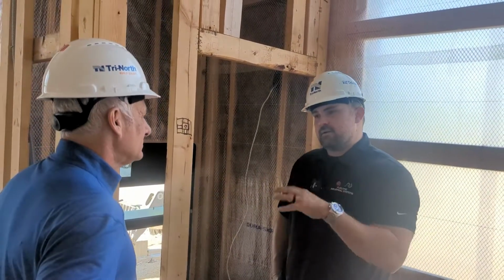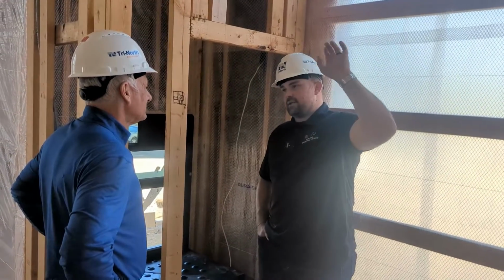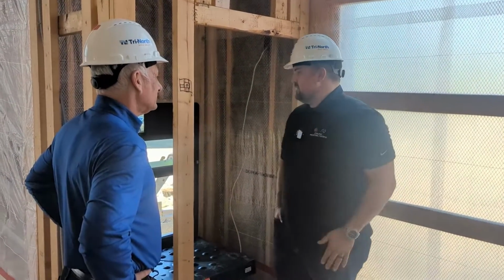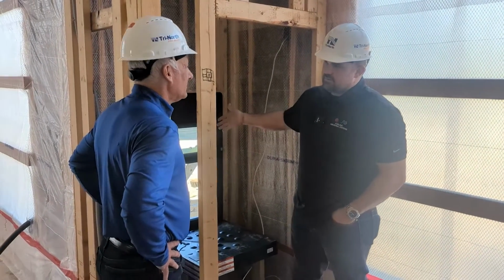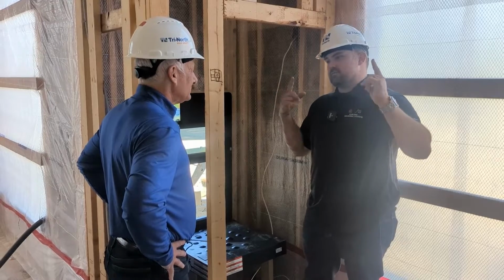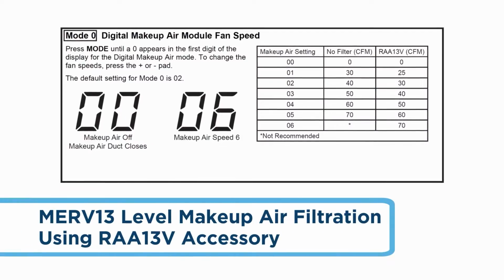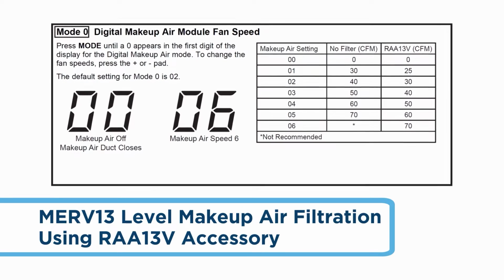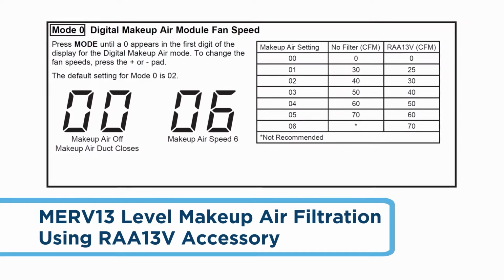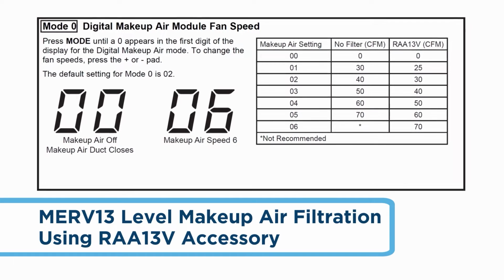They needed makeup air in the unit. They wanted it in the unit, so they're gonna have to run ductwork down here. They had a much larger DOAS unit. What we were able to offer them was the makeup air in the unit, so it reduced the size of those DOAS units dramatically. Right. So instead of having to run ductwork in here and inject makeup air from an external position at the roof, all they had to do was install here at the unit.